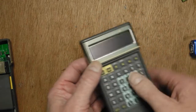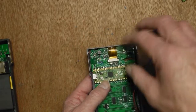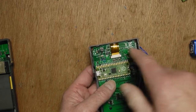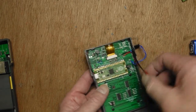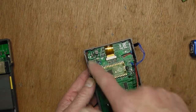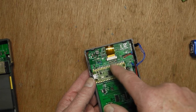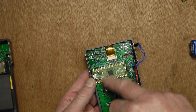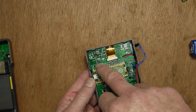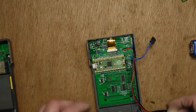There's an OLED display there, temporarily held in. I'm going to have to 3D print some sort of frame or something to attach it to the PCB probably. And I've got the battery connector here for a PP3 which runs everything. 12 volt step up converter there to get the 12 volts that's needed for the OLED display. I've jury-rigged or jumpered the transistor that turns the display on. I've got that as a possible low power feature.